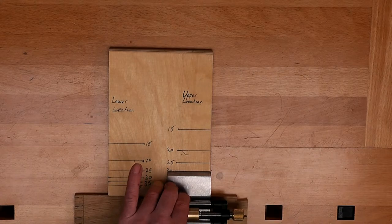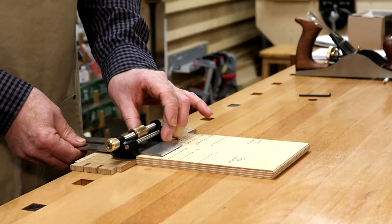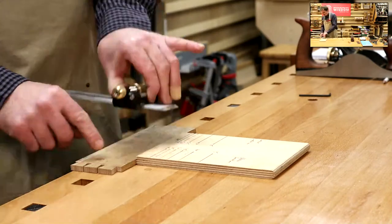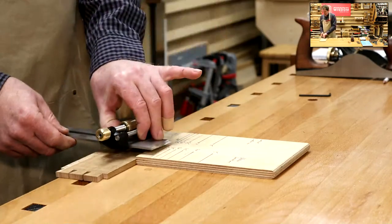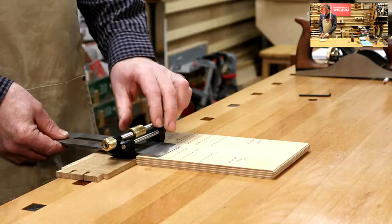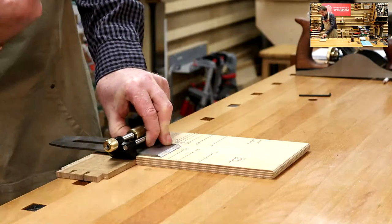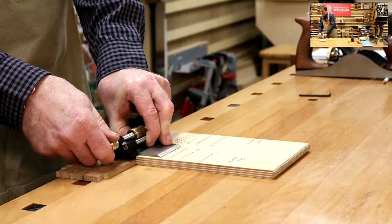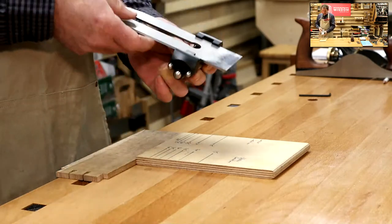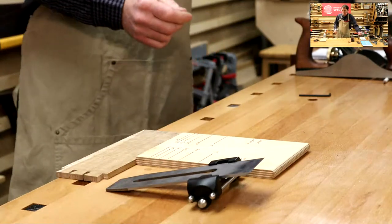Let's look on three a minute as well, Ben. That's just, okay, that's there. So I'm using the board as a clamp stop. Come up to. I pulled the jig up. The bit of oak I've got in here, which I can slide about, is just really to help me support the jig so I'm not actually holding it up in the air too much or dancing about, and to help you guys see what's going on. I made sure I pulled this upwards, so I'm trapped against the upper setting on the jaws. The upper setting they actually recommend is easier to use. It gives you more protrusion, it makes it more stable.